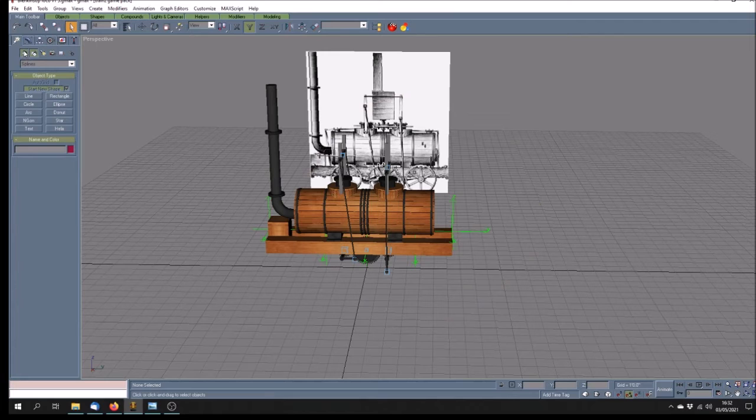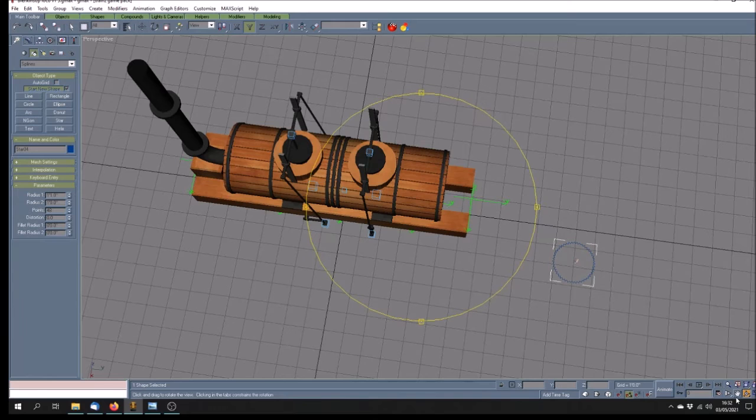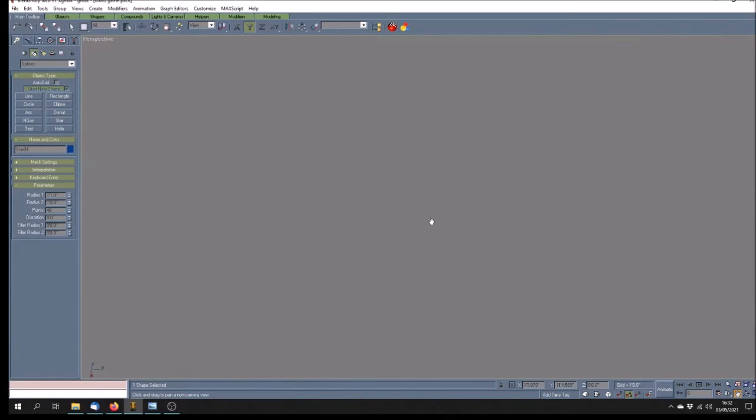A quick way of doing it is to choose in the splines a star and draw yourself a star. There we are. And let's try and make one where the inner radius we want is a foot, and the outer radius, we're going to make the teeth about 2 inches long. So it doesn't look like much there, but if we now put in, let's see, for that size, say 48 teeth. Just zoom in, and we've got the basic line.